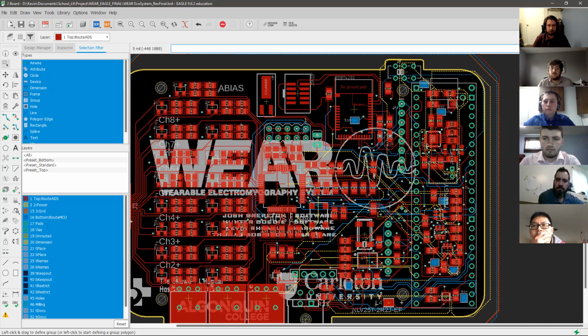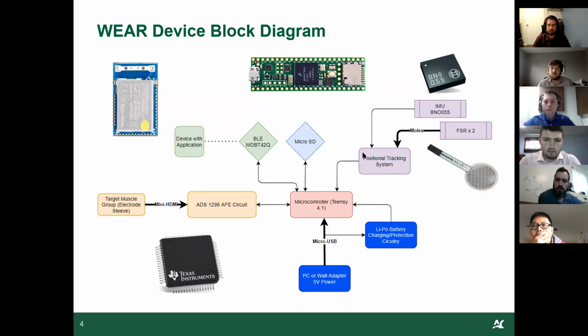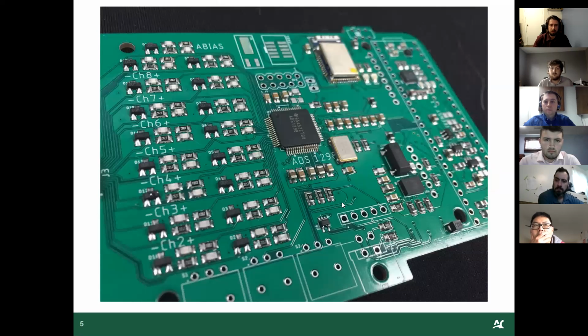And we got this board printed and manufactured, and we populated it using a stencil that came with the manufacturing, and then using solder paste to go over that stencil, and it goes on all these little pads, and then placing the components one by one and sticking this into an oven. We actually used a toaster oven that was modified to carefully watch the temperature and get the reflow profile right so that everything was soldered correctly. We ran into a couple hiccups, but we'll talk about the troubleshooting in a second.